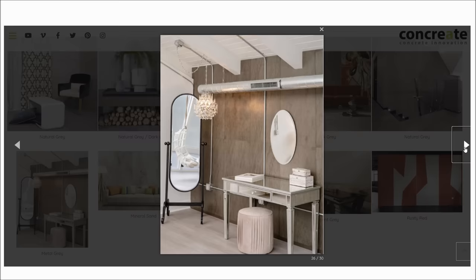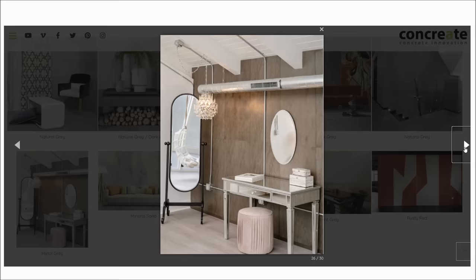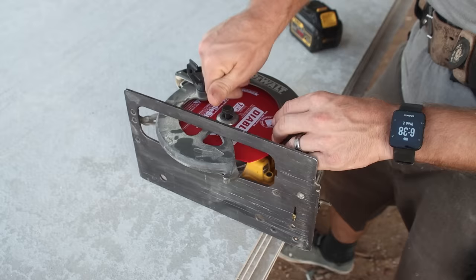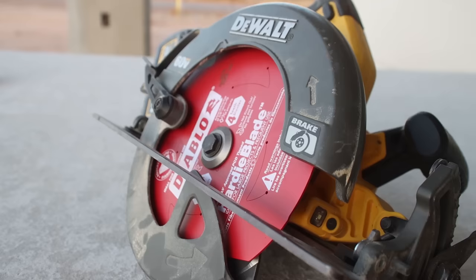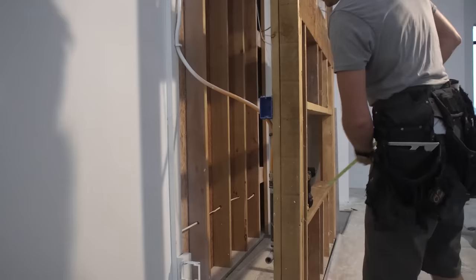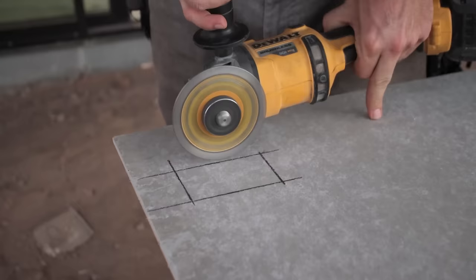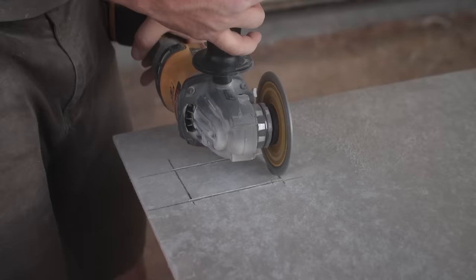I found a company called Concreate that makes real concrete panels thin and light enough to mount to the wall. The concrete panels can be attached to cement board, plywood, or even drywall. We like the insulation properties of masonry, so we decided to first skin the entire fireplace using four-by-eight sheets of quarter-inch cement board. Although it requires a special blade, cement board can be cut using a standard circular saw. For detailed cuts around outlets and light switches, we found it easiest to use an angle grinder with a diamond saw attachment.